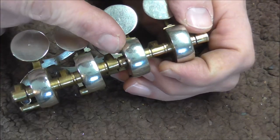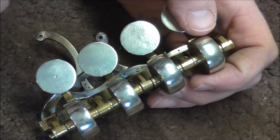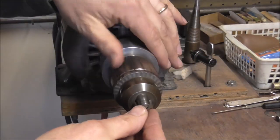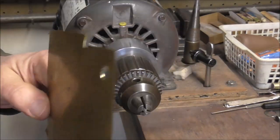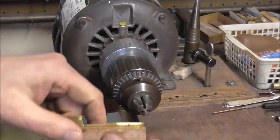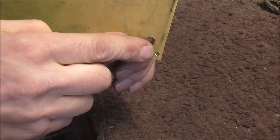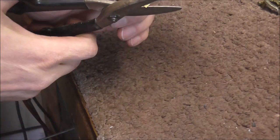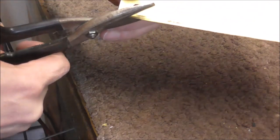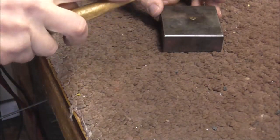So I'm going to make another one from the same valve stem for this lever. I think the other two are going to be too thin, and I'm going to need to do that with sheet metal. I have the correct size drill bit, and I'm going to put that in the bench motor. Here's the correct size sheet metal. I have a block of wood to back that up, and then I'm going to drill this out. There's the little hole, and I'm going to use the tin snips to cut out around that.